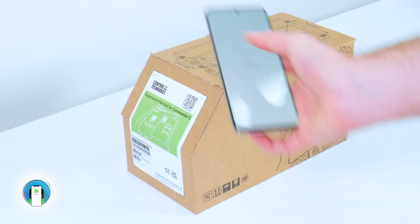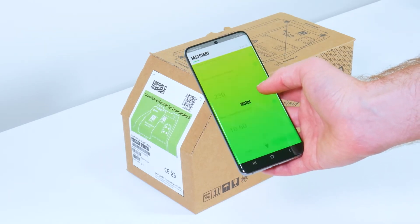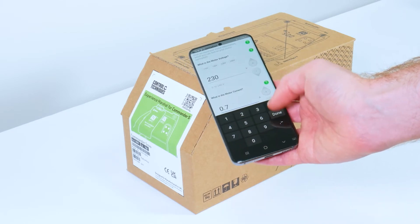On the drive dashboard, click Fast Start, then enter your motor details starting with motor rated voltage, motor rated current, motor rated speed, and the motor power factor.